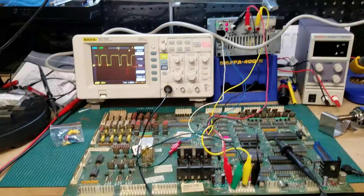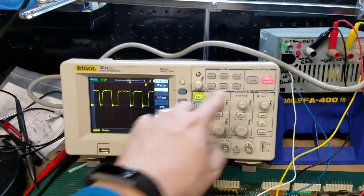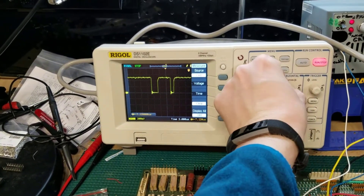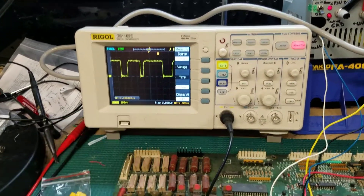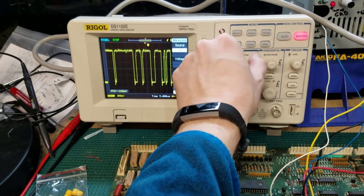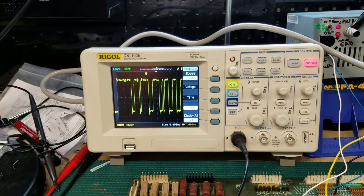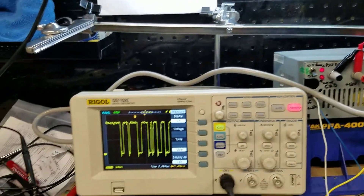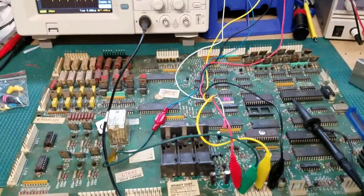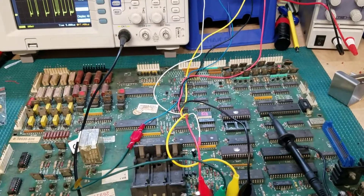Our final example is pin five of the 6808, which is going to be our VMA signal. We can see I went ahead and run-stopped this because it's clearly working. Pressing the run stop button gives us an understanding of what we're looking at. We can start to see a very similar approach in terms of what we should be seeing from a graph perspective. We can see some key things from a VMA perspective. I have the understanding this looks to be more or less correct for VMA, and we know the board is working correctly today.